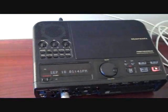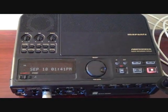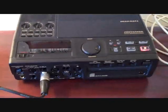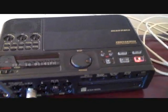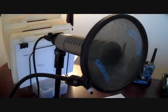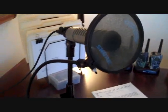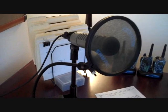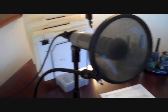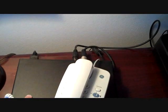Mix out is the back one here and that one goes to my recording device, which is a Marantz CDR420. It's a recording device that has a hard drive, but it also has a CD burner right in it, so you can burn a CD, which is kind of nice. So mix out from the digital hybrid goes into the CDR420. And then I also have from the send — which is an XLR jack — that goes over to my microphone, which is an Electrovoice RE20. Pretty standard for a lot of radio stations. Having a great microphone really helps in the quality of your audio. So my microphone goes into the digital hybrid, into the send — that's how the caller hears me.